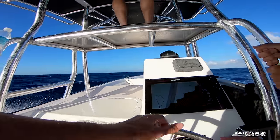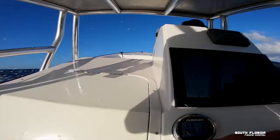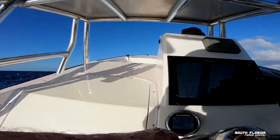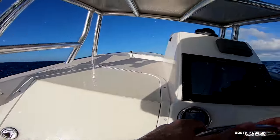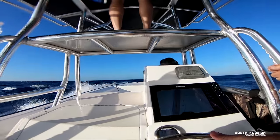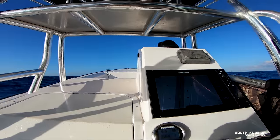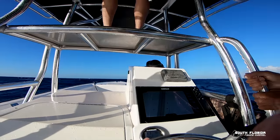The fiberglass started breaking off at the top bolts on the transom, creating huge pressure on the bottom bolts below the waterline, which started cracking through the fiberglass, causing water to flood into our bilge. We quickly slowed down the boat and tied ropes around the engine to try and relieve some pressure off the bottom bolts. If the engine ripped off the transom, the hole below the water would have been so big that it would have only taken a few minutes for us to sink. Every wave was cracking the fiberglass more, and this is where the video starts.